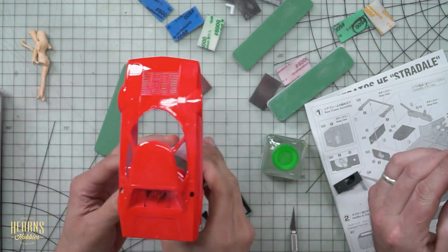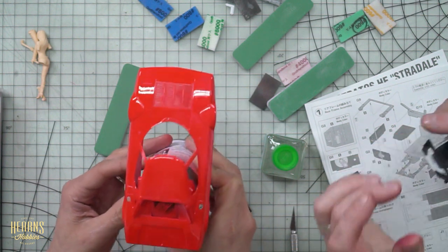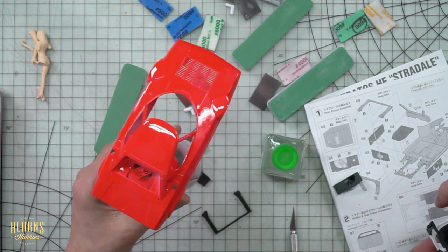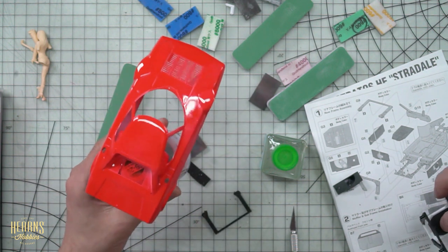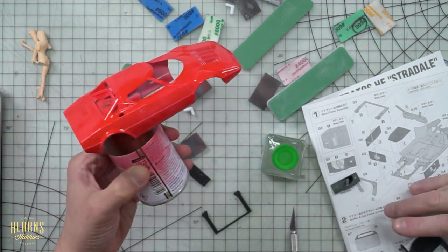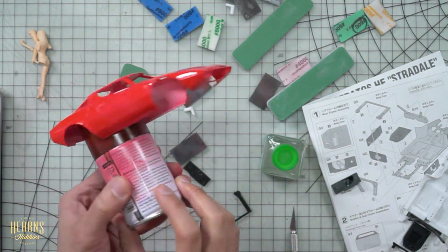You see how it's got this really wet look to it? So this is not quite a wet coat. This is a damp coat. This is a medium coat, I guess, because this is a little bit heavier than the first dusting coat I put on it. But we've used that like a primer to guide us. This one's got a little bit more on it.